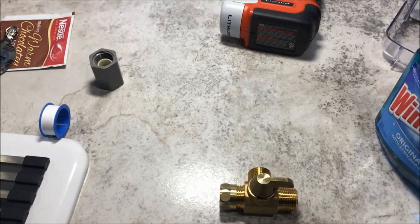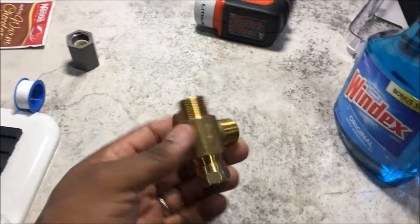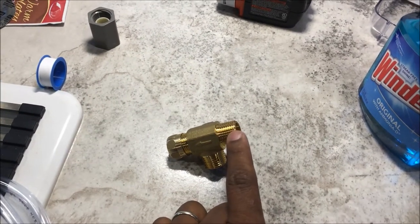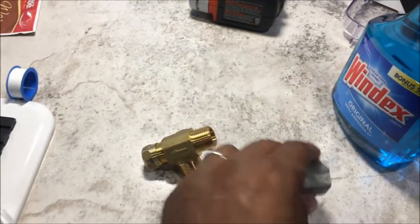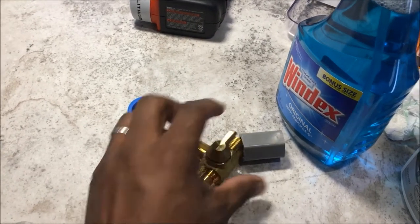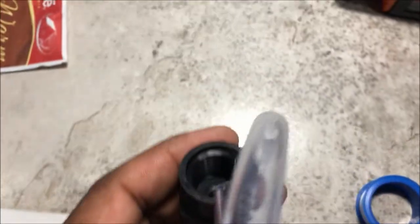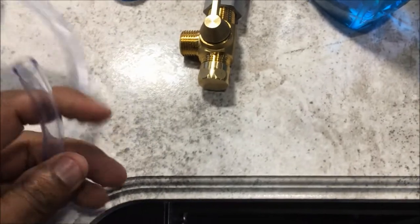The best thing about this particular kit is it hooks right up onto the pump. There's an arrow on it — that arrow is to go away from the pump. This end screws onto the coupler that screws onto the pump. You put your Teflon tape on there, screw this on, and this screws into here. Then your line that was on the pump goes into either one of these, whichever one you want. This piece has threads on it and threads into whichever port you choose.